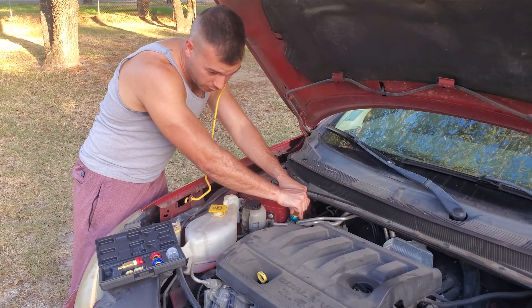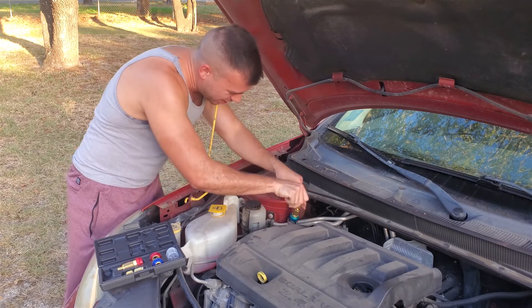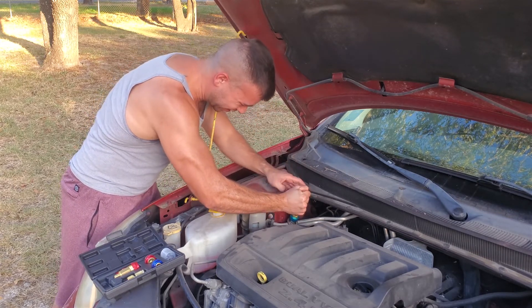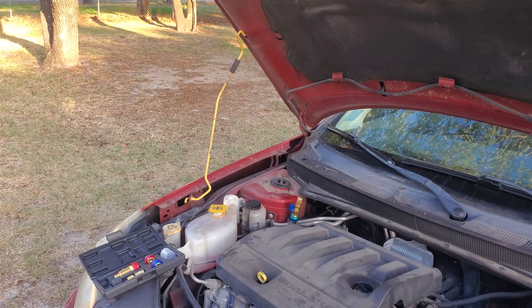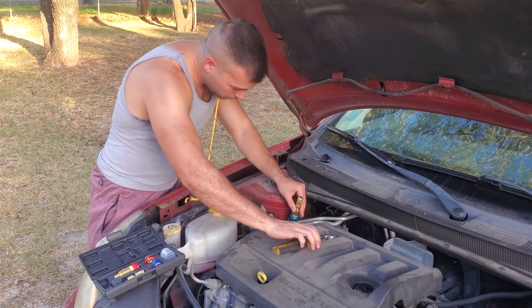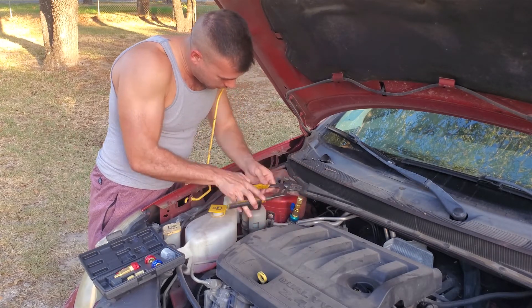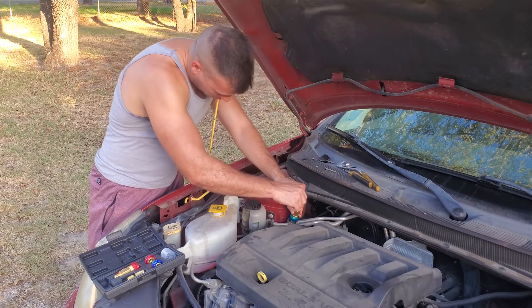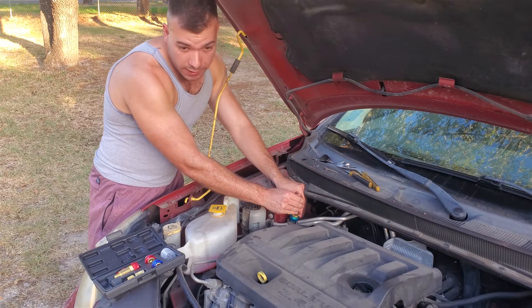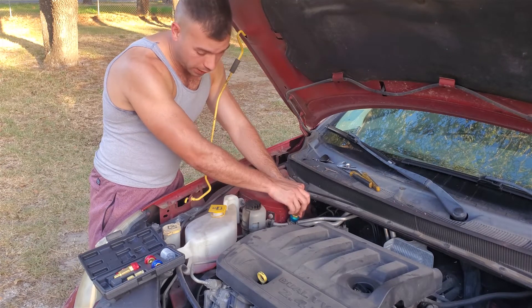Now here I am loosening the core. We're going to see if anything leaks — I can just tighten it back down if needed. I need some extra grip here with pliers; these knobs are knurled. Now we're going to loosen it slowly, so that as the gas is vented past the valve stem, we'll see if our seal is holding. If it's not holding, I can always just thread it back in.